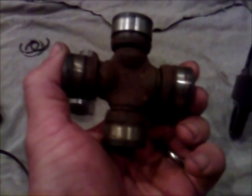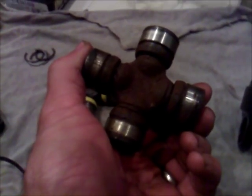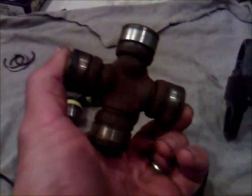And then we're on to these U-joints, which when I took them out, were covered in rust because the bellows have failed. And I took the boat out 3 or 4 times. Took it out once, twice last year, and in the water several times. So this was working in the water, and they were actually in pretty good shape. But since I had this all apart, I wanted to replace it.